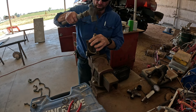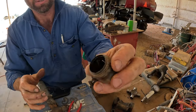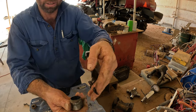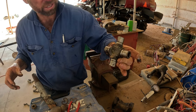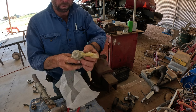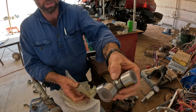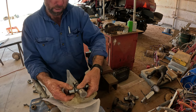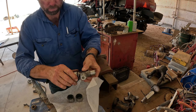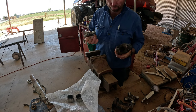Now these ones - they're actually sealed. They're supposed to be sealed. You can see the needles - little needle rollers with grease. Now these crosses are actually sealed; usually you can grease them. On a normal PTO shaft you can grease them, but for whatever reason on these you can't. The new one has actually got a little set bolt there where you could put a grease nipple.